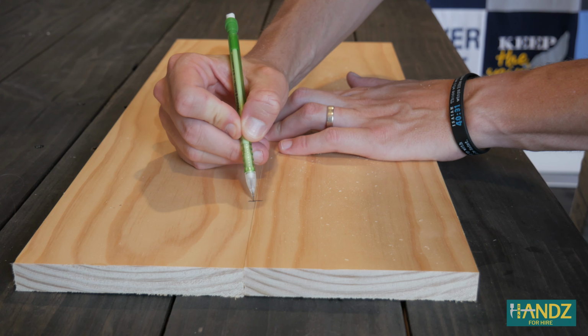In order to hold it all together, I've got these 12-inch DeWalt clamps. Glue, a lot of times, will sneak out both sides. It'll seep out. And I'll end up just sanding this down after. I'm gonna sand this entire board. So now I'll just go around and wipe any glue that came out. See how it beaded up on this side. And like I said, it's gonna be on the wood, but when we sand this, it's gonna all come off. So we're gonna let this dry for probably 12 hours.